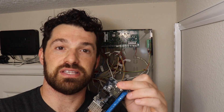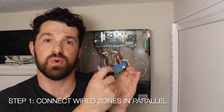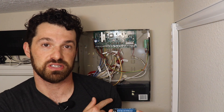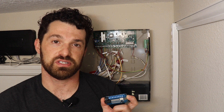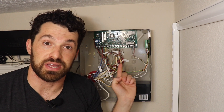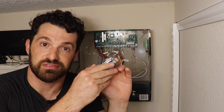The key difference between the boards is that the Pro has Ethernet connectivity; this one is Wi-Fi only. Otherwise, installation and functionality are effectively the same. Step one is to connect zones one through six on the alarm panel interface module to wired zones or programmable outputs on the Vista panel — one zone on the interface module per zone or output. Step two: if you want to arm and disarm remotely, you'll need a free zone to make a key switch, which connects to the relay terminals on the interface module.